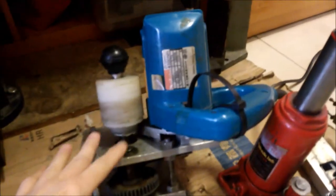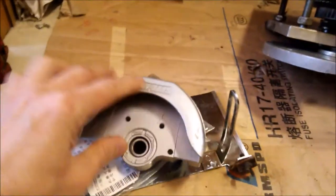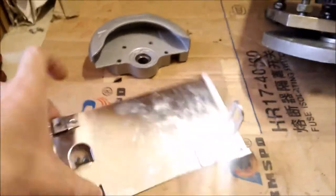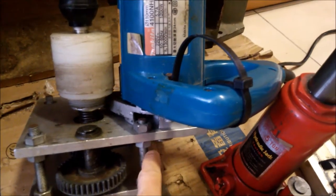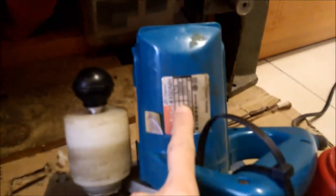The first component of the mechanical power unit is a small Makita circular disk saw, model 1200. I disassembled the original smaller circular saw blade — about four inches — and also removed this part. I mounted the shaft on a pulley or pinion to provide power.